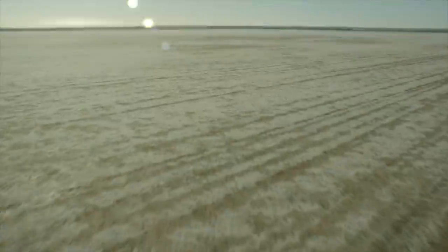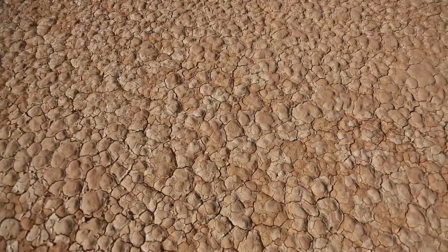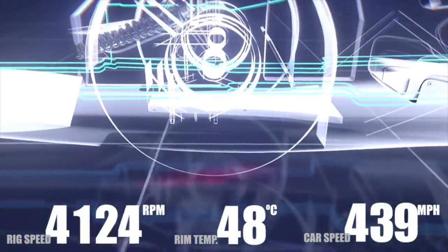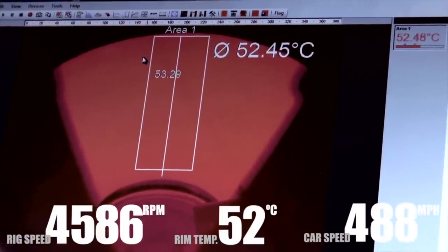Now in South Africa, we're on a desert. We've got a very hard surface, but you need a solid wheel. The issue with a tyre isn't so much the fact it's a pneumatic tyre, it's actually holding it onto the rim. Very few people have run a tyre successfully between 400 and 500 miles an hour, because the bead of the tyre lifts off. As it lifts off, it deflates the tyre. So you end up with four flat tyres at 450 miles an hour, and it's very difficult. People have tried bead lockers and all these different clamping methods.